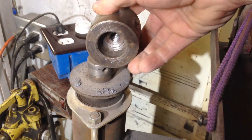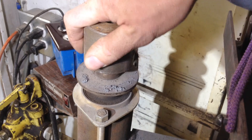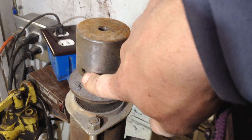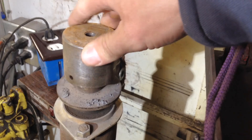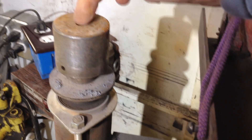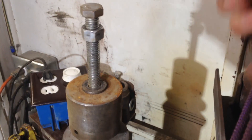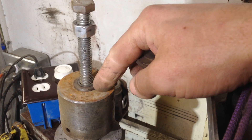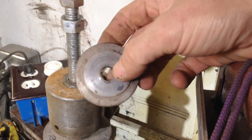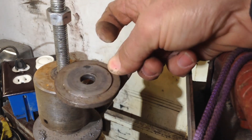Sometimes you need more holding power than that, so I machined this adapter that presses down on the shaft — it's a really tight fit. The shaft's a little dirty so it has a hard time going on. There is an Allen screw in it to lock it down if you want, though I never use it; it fits tight enough that just by pushing it on, we're good to go. I think the magnet holds it down a little bit as well, even though this has a hole clear through it. That's a threaded hole for a half-inch bolt. I have also made a couple of very specific machined washers — this one has a step in it — so that if things have a bigger hole than the half-inch bolt, they will still stay centered on there.